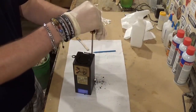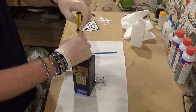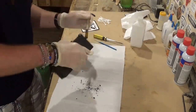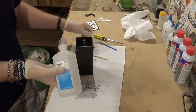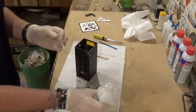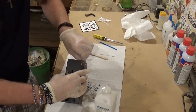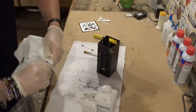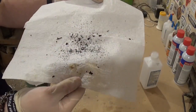I am being very careful here because this is the main part of the laser — the laser head itself that does the actual work on engraver projects. I am no expert at cleaning lasers; this is just what I do to take care of them. I will now take some Q-tips and very carefully clean the laser lens itself. Of course they can get scratched and then you have to replace them — thankfully I haven't had to replace the one in the Ray 5 20-watt.